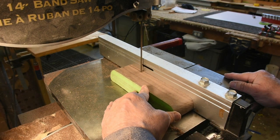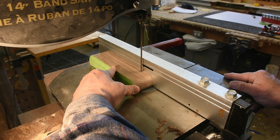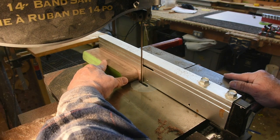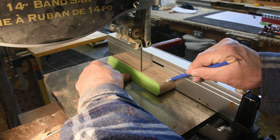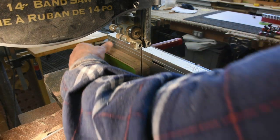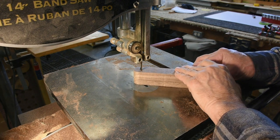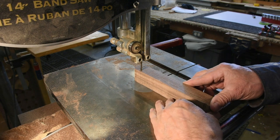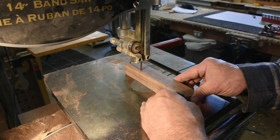I'll need to move the fence — you might be wondering why I didn't just flip it around, but it's because the front is sloped and I want to make sure I'm not cutting off too much. There's the back cut. I've moved the fence so the quarter inch is at the top of the drawer. There's the front cut off — you can see the bevel on it. Now we're doing the pocket, and you always have to be careful not to flip the piece around. As soon as I cut it out and pull it from the blank, I put an X on the top so I know which side is which.